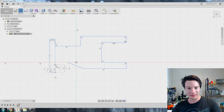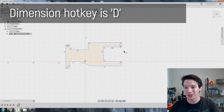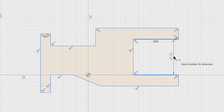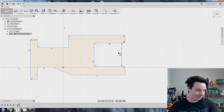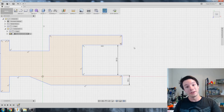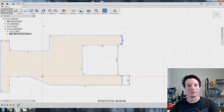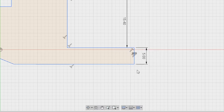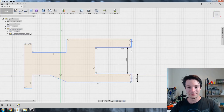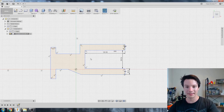This is just line-based — there are no curvy aspects to it yet. Now I'm going to add some dimensions. Press D for dimension. Our most important distance is where it holds onto the desk, so I've got 15.4mm here. I want my top and bottom pieces to be 5mm. I'll use an equal relation to make the top equal to the bottom, and collinear to lock them together. The distance into the desk I want to be 30mm.